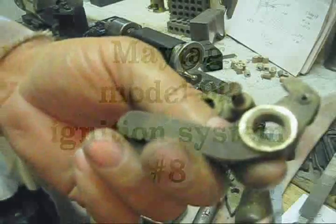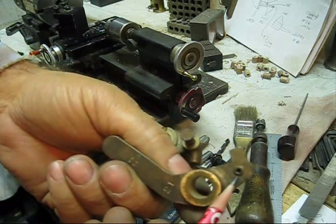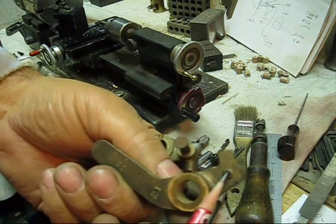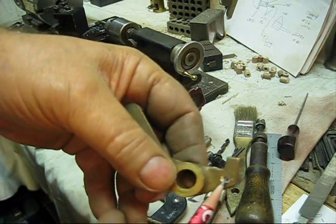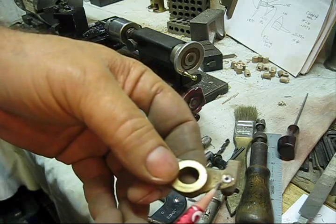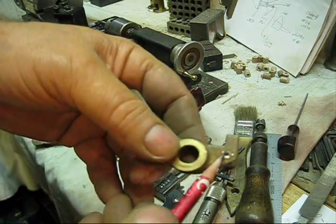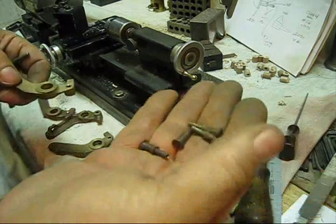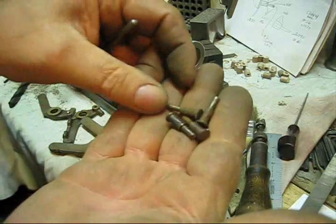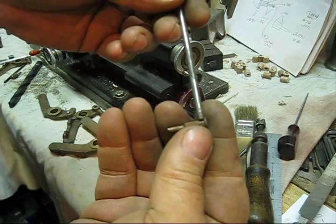You could go with the duct tape and just wrap it, but in order to remove the back side of that pin where it's been rolled over with the punch at the factory, what you do is take a bigger size drill bit and drill the head of it off, just down below where the bent-over part is. Then take a punch and punch that out. These rusted pins have to come out because the shoulder's too big to put a roller back on there.